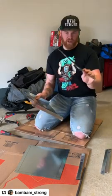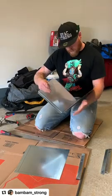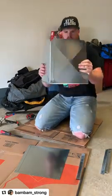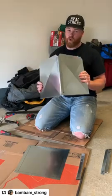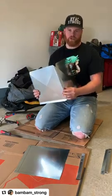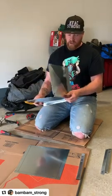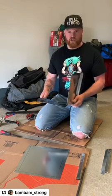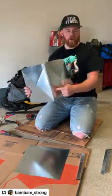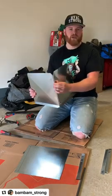The side pieces don't have a fold over — they just slot into the cleat like so. One thing I hate on transitions is when people tape the corners. It looks terrible. The customer is going to think it looks terrible and it ruins the quality of your work. I like to do it this way, pop a couple of screws in it, and it looks much better and it's a nice airtight seat.